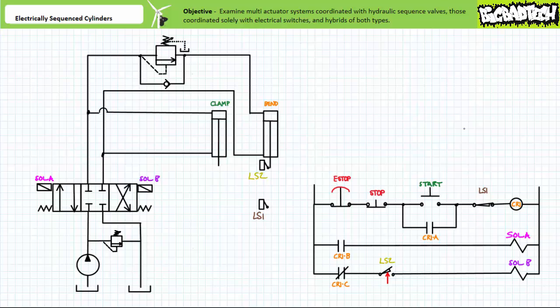The primary hydraulic circuit is paired with a pilot ladder logic diagram that governs its operation. The primary hydraulic circuit is almost the same as our previous hydraulic circuit making use of a single sequence valve on the cap end of the bend cylinder, only this time it includes two limit switches — LS1 and LS2 — at the limits of extension and the limits of retraction respectively. Note in the de-energized start state, the bend cylinder is assumed to be fully retracted and is triggering limit switch 2. We should therefore expect limit switch 2 in the ladder logic diagram to be held in its activated opposite state.